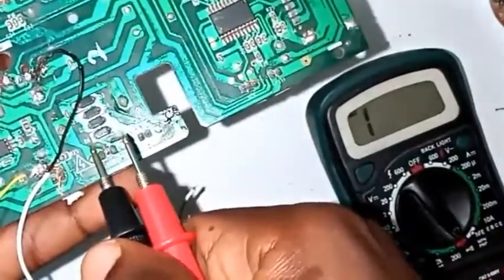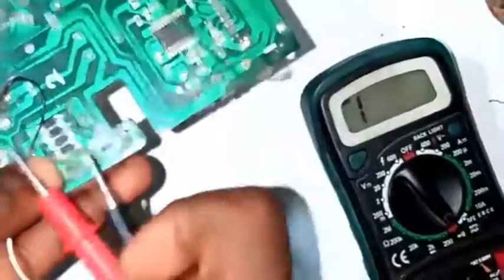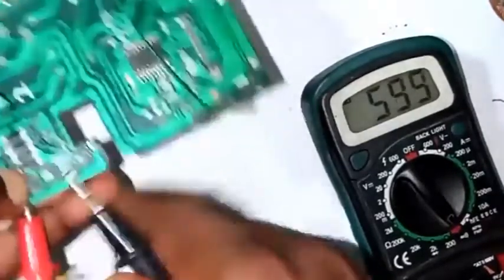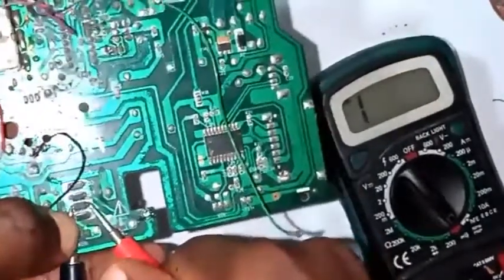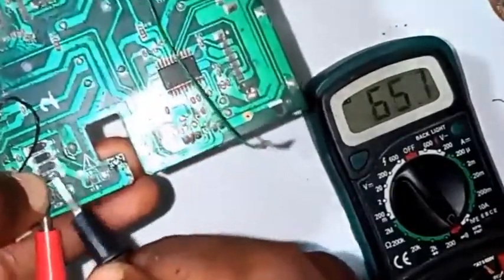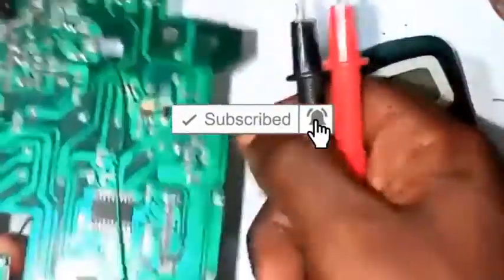Lastly, let me check this type of diode — you can see markings like D6 or similar, which indicates it's a diode. Let's check if these diodes are okay. First one: no reading on this side, so let's interchange the probes — it's reading in this direction. Change to confirm — no reading the other way. So this one is okay. Second one: reading in this direction, interchange — there is reading from the other side too? No — reading in one direction means it's still okay. These diodes are working.